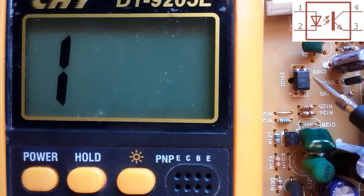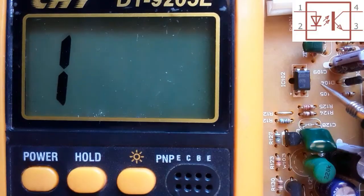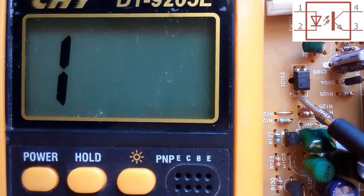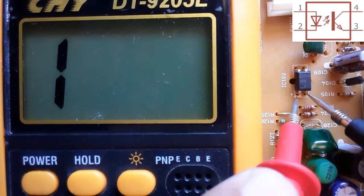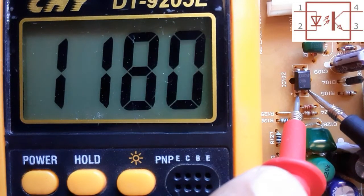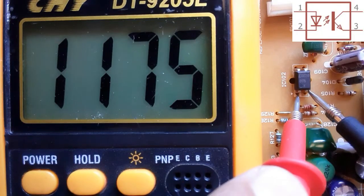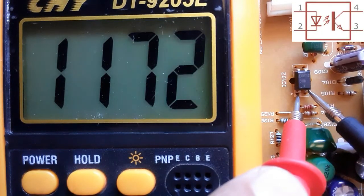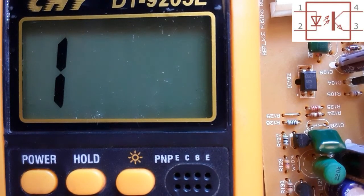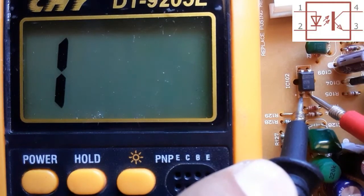We have pin number one and pin number two, and the phototransistor on pin number three and pin number four. We put the red probe on pin number one (anode) and the black probe on pin number two, and we get about 1000 to 1100 millivolts — this is a good diode. If we swap the probes, we should not find anything, and indeed nothing shows in the multimeter — this confirms a good optocoupler.